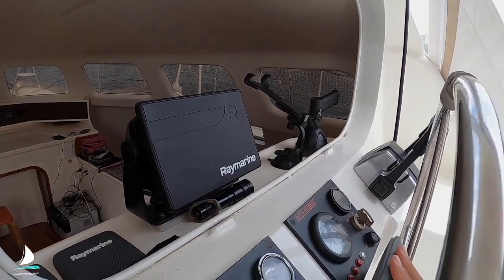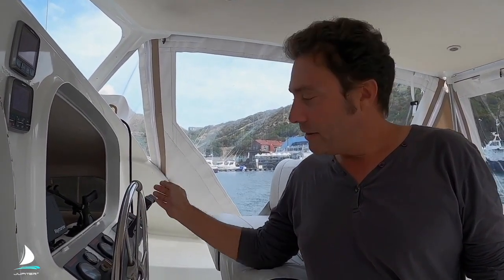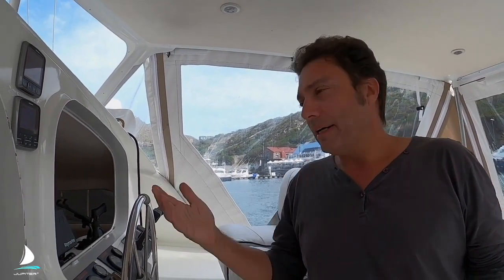This system is rated at 7,500 kilo boat displacement, or 16,000 pound boat displacement. This boat is a little heavier than that - rated at seven and a half tons, my boat is about eight and a half tons - so there was a good chance this would work. Don't be put off by those numbers; they're just a guide put out by Raymarine. You could have a heavy boat but if it's feather light to steer, you could still use that sort of autopilot. This boat is light to steer - very friction-free in the steering.